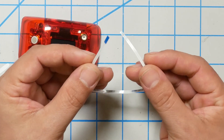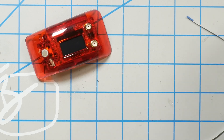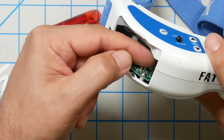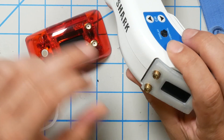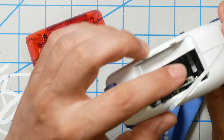If you're not interested in using a soldering iron, modules like the TrueDX come with a little ribbon cable that plugs into the head tracker bay, where there's an alternate 5V output. You run the ribbon cable through the goggles and plug it into the module — it gets power and it's good to go. You can tape it to the front of the module or run it inside so you don't even see it.